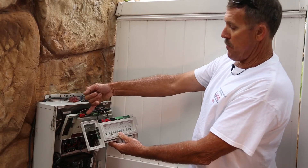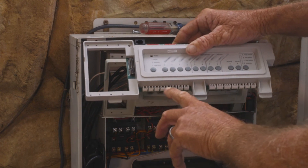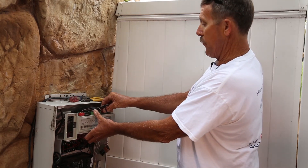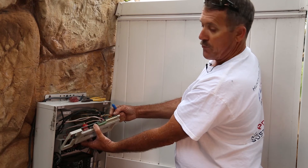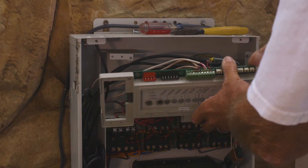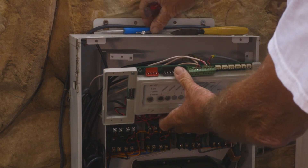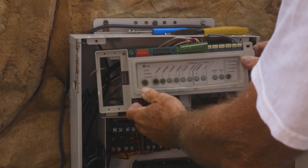The other changes: our spa side remote stays the same, our 10-pin connector stays the same, but they've added a service port, and all of our auxiliary relays, intake, suction, and return relays have moved to the bottom. I'm going to remove all the low voltage stuff and the 24-volt power — I'll disconnect that now so we don't burn up a transformer. The 10-pin connector is one of the hardest to get off; I start in the groove with a smaller screwdriver and wiggle it back and forth until it pulls straight off.